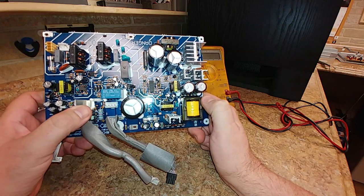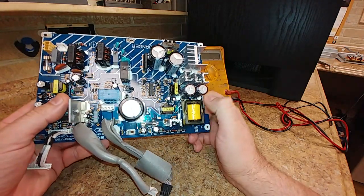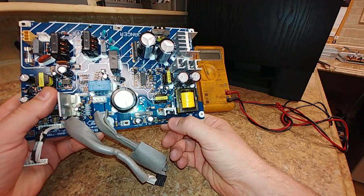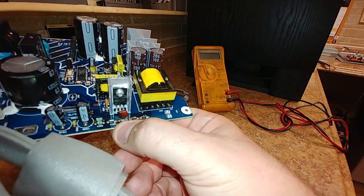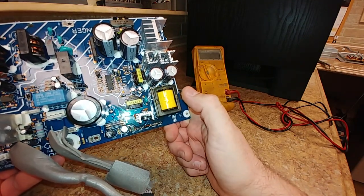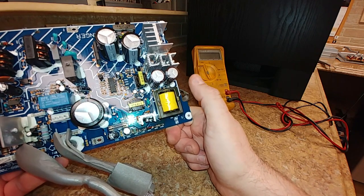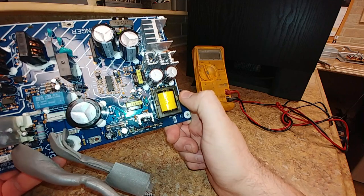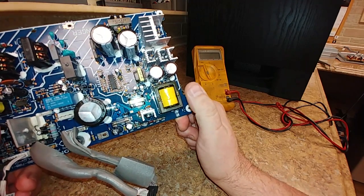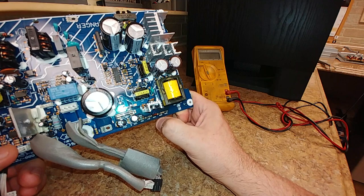I don't know what the voltages are on those, so I'll have to download the service manual to find out what these are supposed to be. I noticed that when it comes off this trace over here and goes to this side of this capacitor, that capacitor is a little discolored. There's a trace coming from this transformer right to that capacitor, so somehow the voltage changed here. Nothing else on this side looks messed up, including the little resistors between the capacitors and the transformer. I've got to find out what voltage is jumping from one side of the board to the other. There are three diodes — two here, one there — and two resistors. I found out the specs of those resistors: they're supposed to be 4.7 ohm at a quarter watt with 10% tolerance.